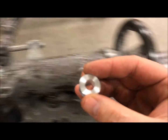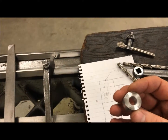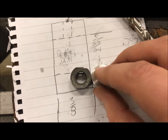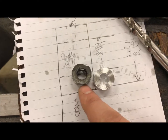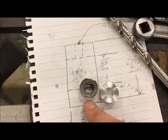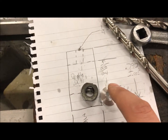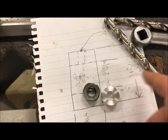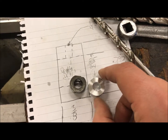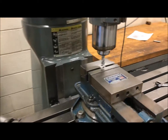So there's the start of it. Here's the original and here's the new one — you can see the difference. We need to drill and tap our hole in here, which I'll do over on the milling machine. There are also these little flats milled on here — I'm not sure they actually do anything but I'm going to mill them on anyway. There's one flat here and one 180 degrees from it. When I drill and tap while I still have that orientation, I'll mill that flat, then flip it over to mill the other side.